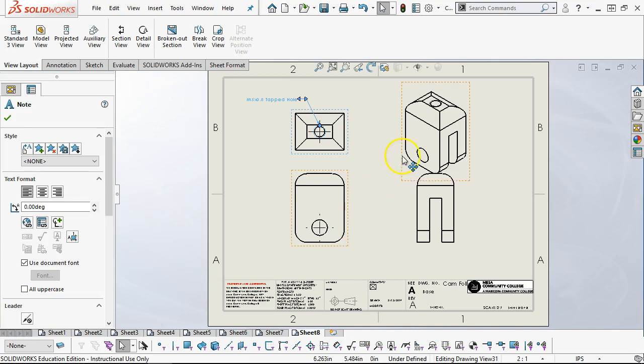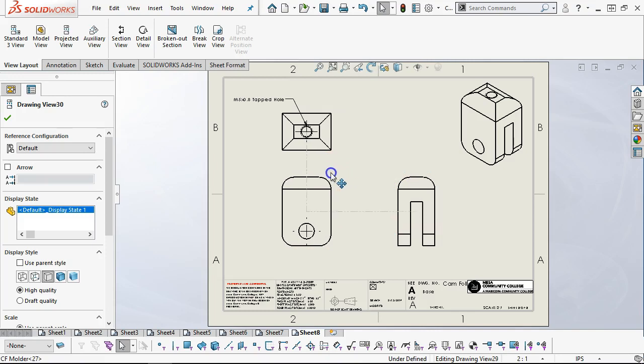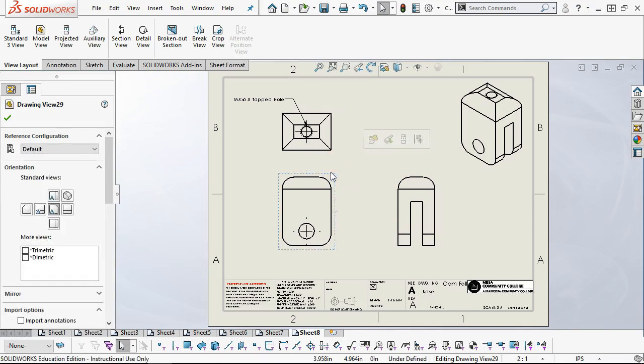The other thing of note is that the bearing that I chose from McMaster was not the DIN standard that was listed in the specifications. So I picked one that was a 1/4 inch shaft, and we'll stay with the pin, but these are going to need to be a press fit. We're going to slide the bearing into the slot. There's a minimal amount of clearance, so it's not going to be a lot of side to side motion, but we're going to need to press through all 3 surfaces, the side, through the bearing, and then into the other side. So we have that alignment to contend with in that geometry.